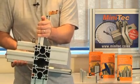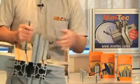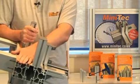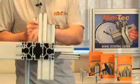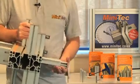The Minitech Profile System is manufactured of high grade aluminium alloy to a DIN standard 12020 part 1 and 2, which ensures straightness of the extrusion over a 6 metre length and also ensures the tolerance of the T-slots, which allows ease of assembly. All Minitech profiles have got the same size T-slot.